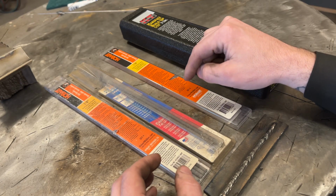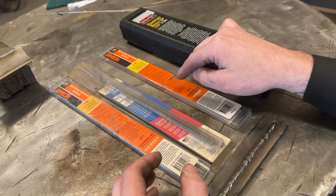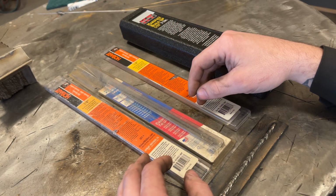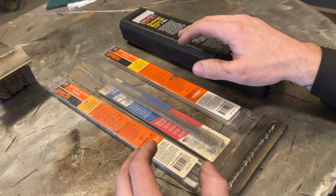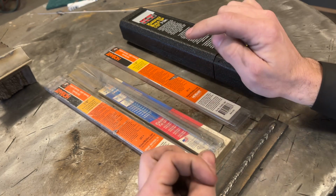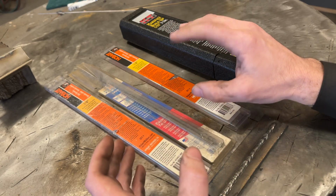Well, if you're welding on some implement of some sort, and it's built out of high-strength steel or ultra-high-strength steel, and you use this on that, you may suffer failure. So one of the things that I found as I've been doing welding and repairing for a long time is that you want to follow a base set of rules, which is always prep your material, preheat it if the manufacturer suggests it, be very specific so you preheat it to their recommended temperatures, et cetera. Follow good common procedures, okay? Just attention to detail, I call it.